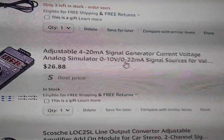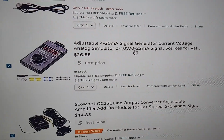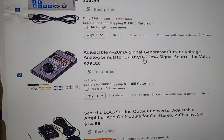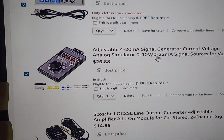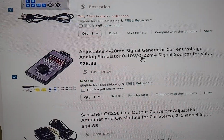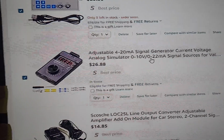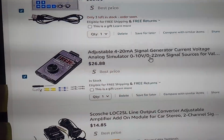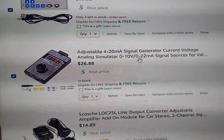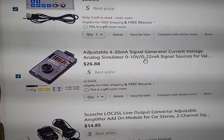And the other thing that you want to watch out for is there are other signal generators, but sometimes they're limited, like they don't have a frequency counter. They'll sell just the PC boards. It also won't have a frequency counter, but it also won't have sine wave. Like it's only square wave or sawtooth or something like that. So just be aware of what you're purchasing. Make sure you search sine wave when you are looking.